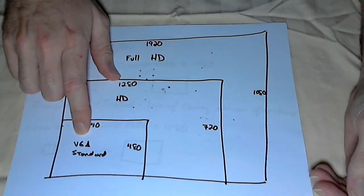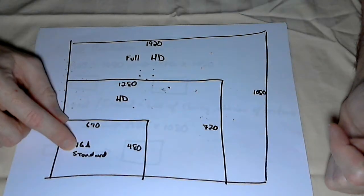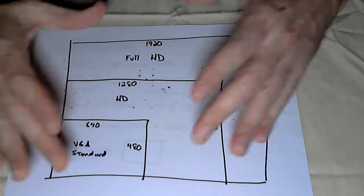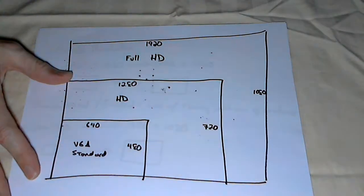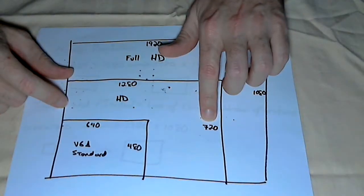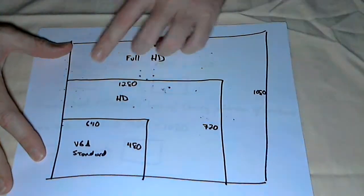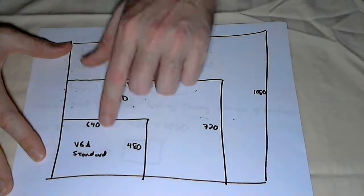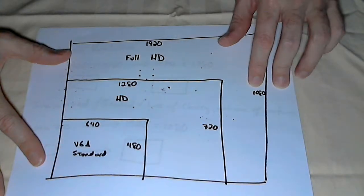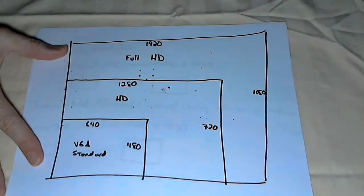When we talk about resolution, this is specifically what we mean. Some of your cheaper ones, for example, that X3000 I was talking about, have VGA or standard definition resolution, 640 by 480. So let's just use this as an example. So here's how big our image is. Whereas some cameras will refer to themselves as 720 or high def. It is 1280 by 720. You notice it's considerably larger than the VGA or standard definition. But when we talk about 1920 by 1080, sometimes you'll just see this as 1080p resolution, much larger.